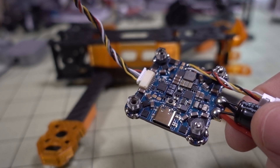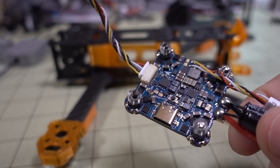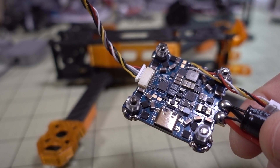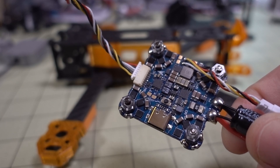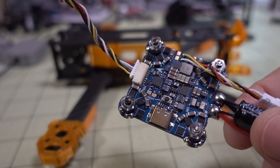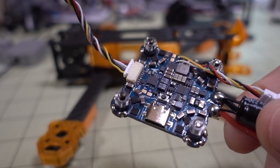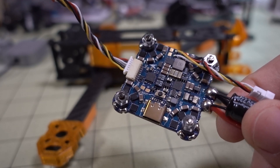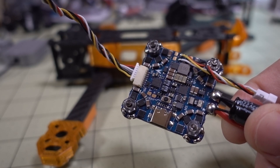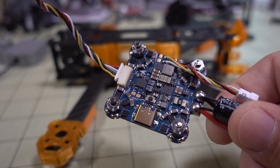If you're looking for a 30 by 30 all-in-one board for a low-profile build, definitely check this one out. Up to 40 amps continuous should be good for most builds depending on your prop pitch and battery. This goes up to 6s, though you'll probably want a larger or additional capacitor for that. Whether the 50 amp burst is enough depends on your build weight and current draw. For a light low-profile single-board build, anything up to a light 2306 motor should be fine. If you're running a bigger motor, you probably don't want this board. If you have any questions, let me know and I'll talk to you guys in the next one.